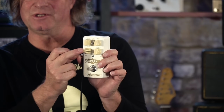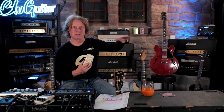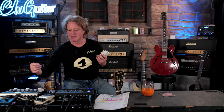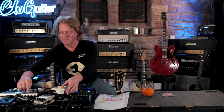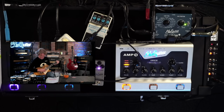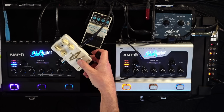And the reason why I do that is the original 45 has a pretty flat bass response. And even though I don't have the bass all the way up, it's on 4, the bass is more than on a modern 800 or other amps like a Super Lead. And therefore, I just use that pedal and we can have a listen on how that would sound with more or less bass. Okay, AMP1 as it is, sounds like this. And now with more bass.